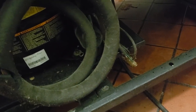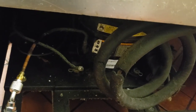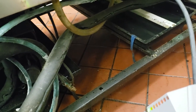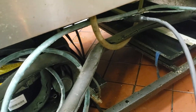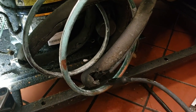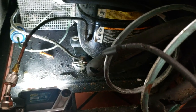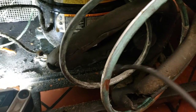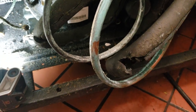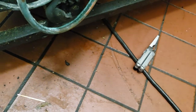I scanned the evaporator and I don't get nothing up there. It's probably in this line right here that all rotted out because it condensates. This is really annoying. This is one of my newer detectors and it's been around forever. I went ahead and peeled it all off because I wanted to make sure before I called them. It ain't gone off once now. The pipeline looks like hell — of course the whole machine does too — but I'm not getting anything. If it was just the insulation, then it should go off right there, and it's not.